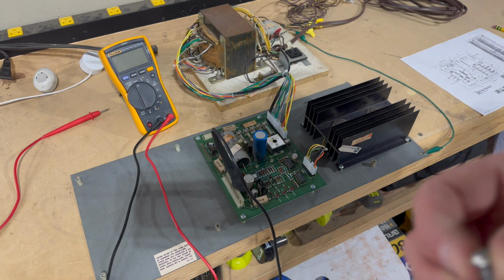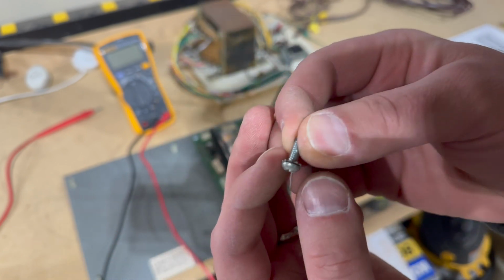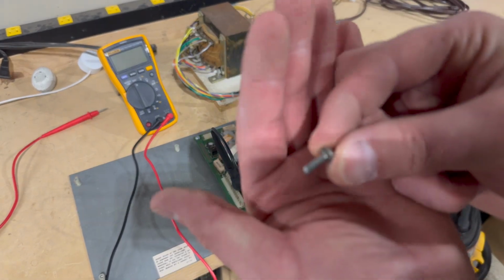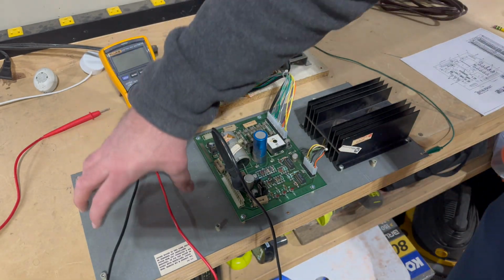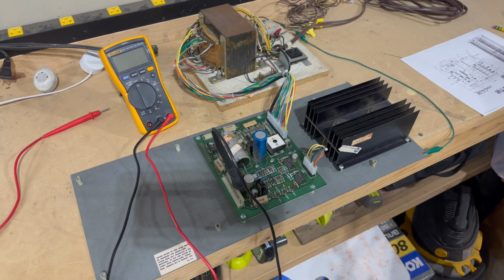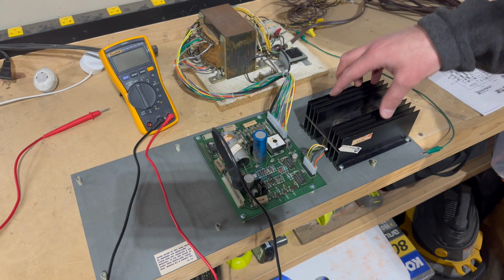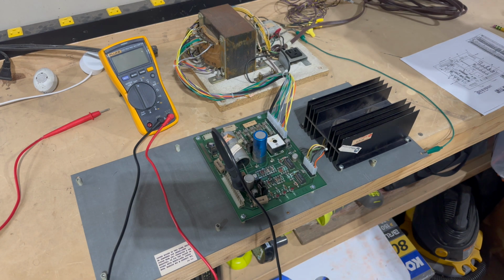The other thing that these screws have is, if you can see it, toothed lock washers, so I had to buy a bunch of corresponding ones for that. So that 1/2 inch size is what's used to mount the PCBs to this metal plate, and the same goes for the soundboard here, and there's another metal plate on the inside of the lower back door that the MPU widget board and ROM board are mounted to the same way. The transistor heatsink, however, uses little 1/4 inch versions of these, which I couldn't find at Ace Hardware, so I had to bust up my Dremel and cut these down to size.